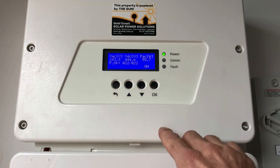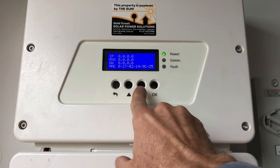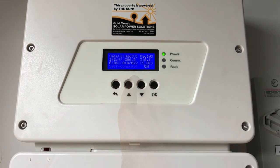The inverter is starting up again — it's coming online, showing 22 of 22 optimizers communicating. The SOK light isn't showing yet but we can see it's connected to the home network and has created an IP address. Now the inverter has the SOK showing, so it's connected to SolarEdge servers. The system is fully operational and connected, so we can now check it on the online SolarEdge monitoring portal. Thanks for watching, I hope it's been helpful.